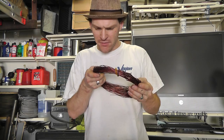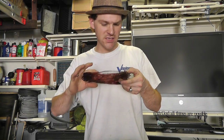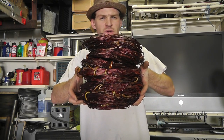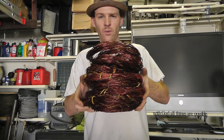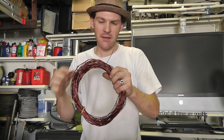It's not perfect — probably got a few nicks here and there — but most of the time when you wrap a coil, these wires aren't going to touch each other in the exact same spot where you've got one or two, maybe four nicks. You can always check with a meter, get a megger, and run a high voltage across it to see if you have a short. I've only been able to successfully take about three motors apart; all the rest of them — about fifteen — just couldn't get them apart. But by grabbing the wire and pulling out those sleeves, that'll help a lot. If you grab the beginning part of the wire and you ruin the first two feet, who cares? As long as you can get those cores out of there, it doesn't matter.